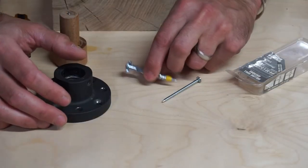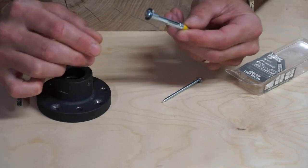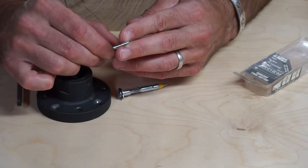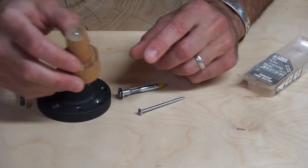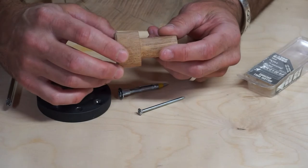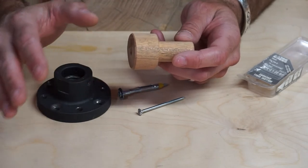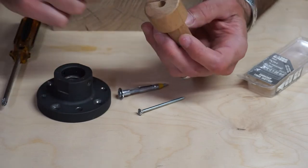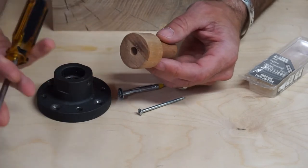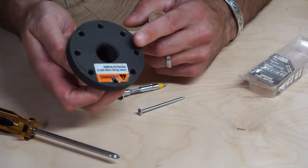If you've ever hung anything on a wall, you've most likely encountered a wall anchor like this. The reason I've chosen this as a component is that it is a threaded screw that already has a very sharp, uniform point that will serve as an adjustable center on the faceplate jig. I personally like to do a lot of work with live edge wood, and the live edge is never flat or uniform — it has a lot of irregularities. Being able to raise and lower this with this pocket right here, which allows me to access the screw head with either a Phillips or flat head screwdriver, I can raise and lower this based on the particular relativity of the surface against the faceplate.